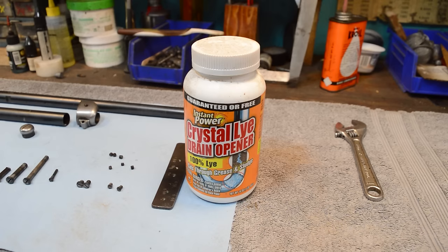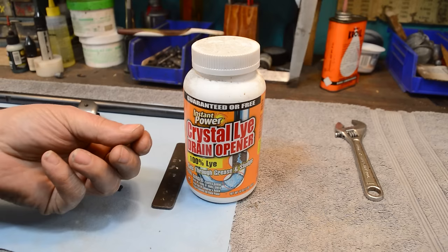What grease does, grease creeps. It causes water to wet and pull back. It will mess up your bluing jobs. The oil on your steel wool will mess up your bluing job. Anything, the oil on your fingers will mess up your bluing job.